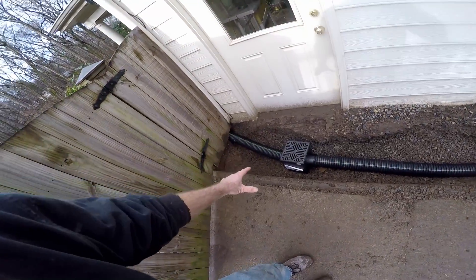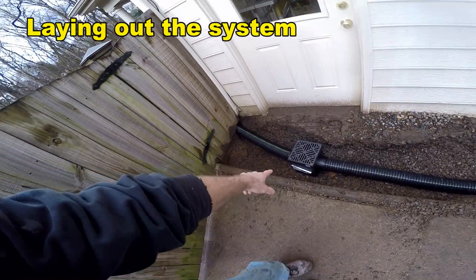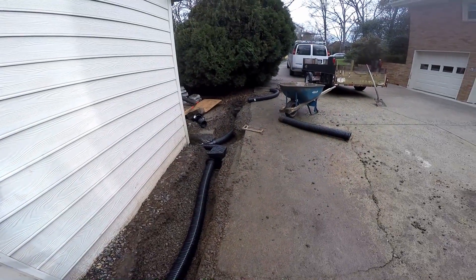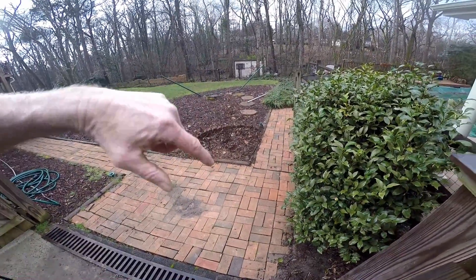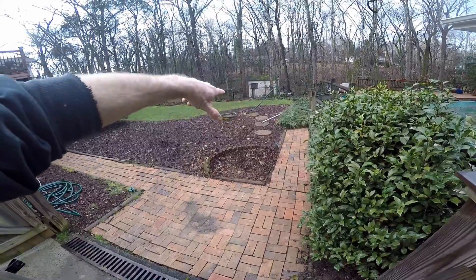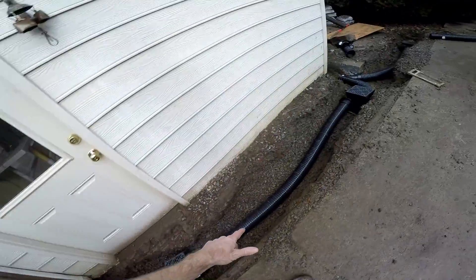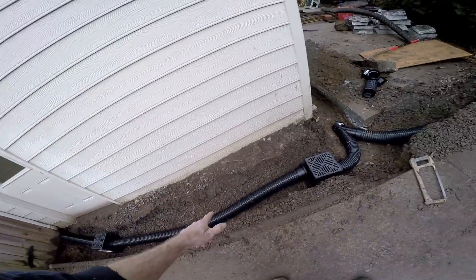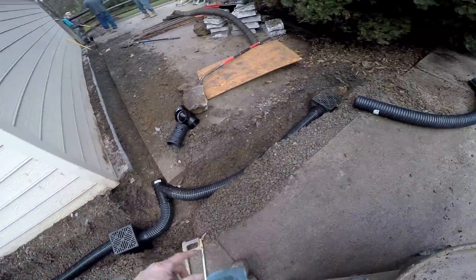So I've laid this out so you can see how this is going to look. Remember, this is perforated pipe coming over to the downspout. We'll hook the downspout up, catch basin here — we're picking up all the water that's coming off this driveway. We couldn't go the other way because of all the brickwork, and there's also fiber optics buried where we would discharge, so we had to dig through grade. Remember when planning your project — water has to run downhill. We're going to go deeper down through our trench. You can see the catch basins and how the system sets up.